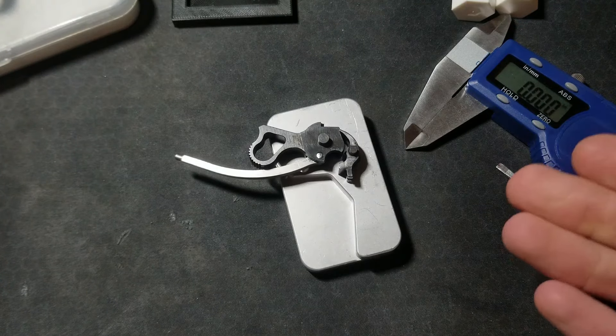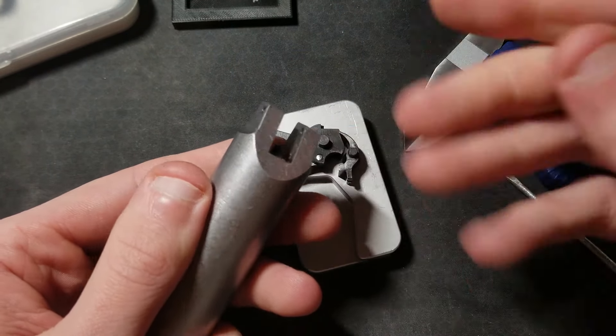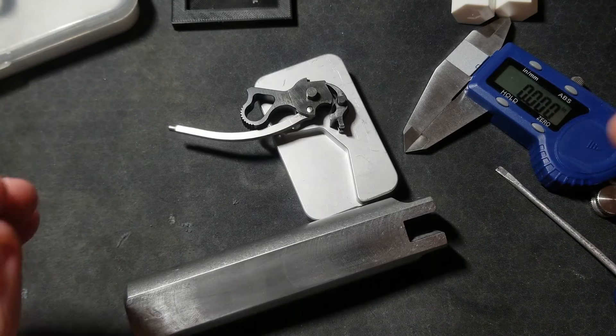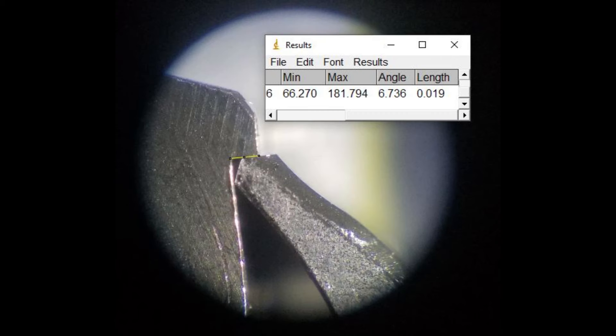I establish rough hammer hook and sear tip geometry in the parallel relationship between the two faces. I calculated that a quarter turn of the adjustment screw on my sear cutting jig results in about a two-degree primary face angle change for in-spec sear lengths, so I can get this parallel relationship pretty close. Once it looks about right, I snap a picture through the microscope at 20x magnification. I upload that into my image editing software where I have a saved calibration file for 20x mag, draw lines on the picture, and it tells me the dimensions in question — accurate to within about plus or minus one thousandth of an inch.